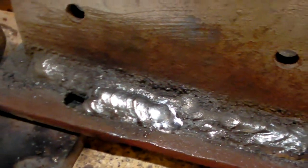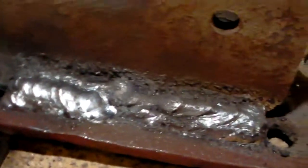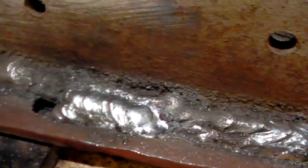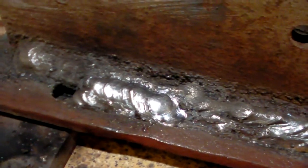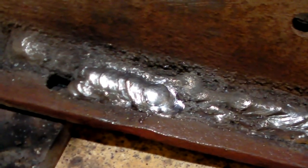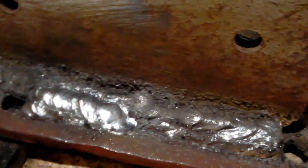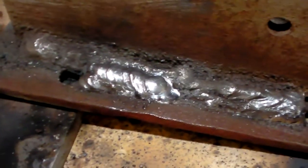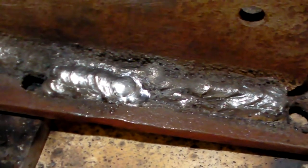There's the new bead right there on top. It's a little hard to see on the camera, but it did lay in there a little bit nicer at the lower amperage. Hopefully that shows you that you're not always going to get an ideal bead and sometimes you just need to make adjustments. The bead before we were running at 115 amps; I knocked it down to 100 on my machine and it laid in there a little bit better — a little bit crowned in the center, partly because I'm stacking the beads, but it definitely laid in better.